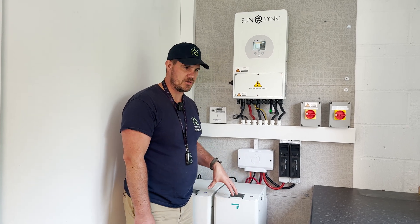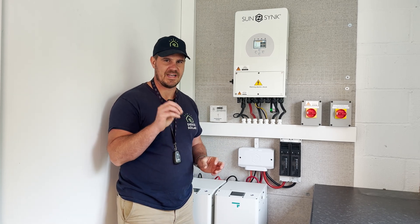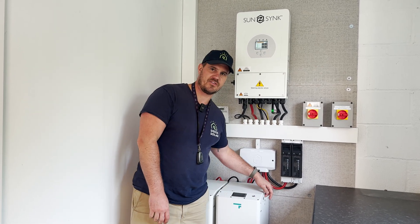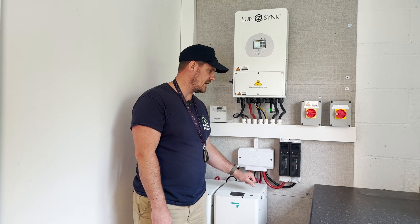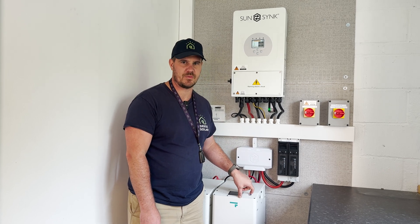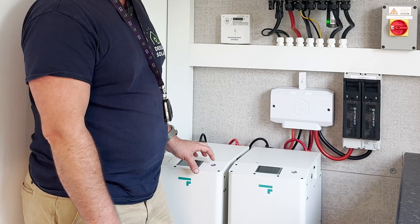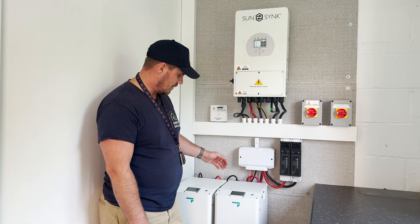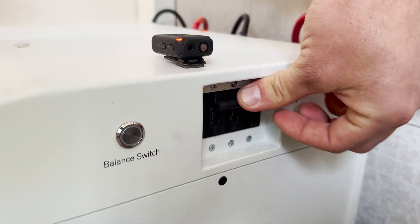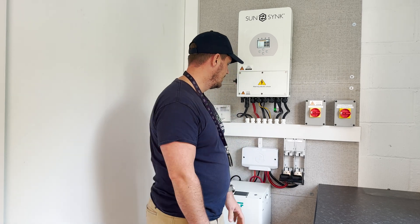On most batteries, you have master-slave configuration. It doesn't matter what way the configuration is because they're all interconnected with communication. You will have on and off buttons and on and off switches, which are like battery isolators on the side. We also have a battery fuse. You will definitely have an on and off switch or a battery switch, or both, on the battery itself. So we've got two stacks and we're going to turn each battery off. Turn the battery button off, turn the DC switch off, then turn the fuse off. Battery's gone off.